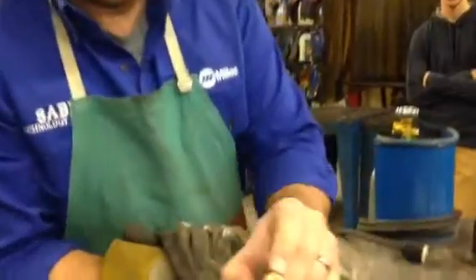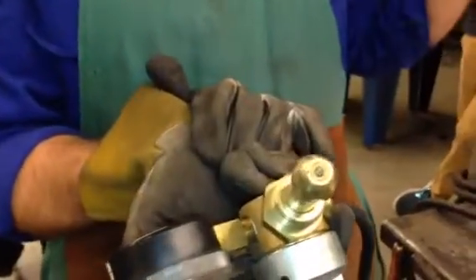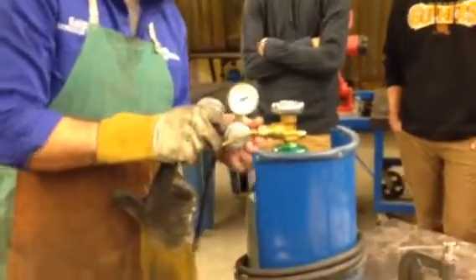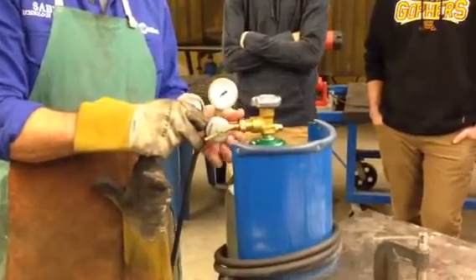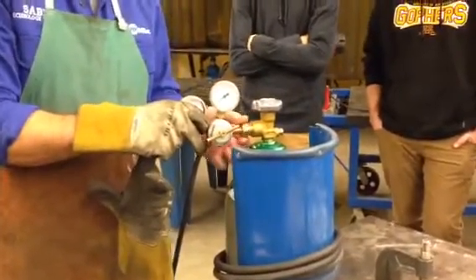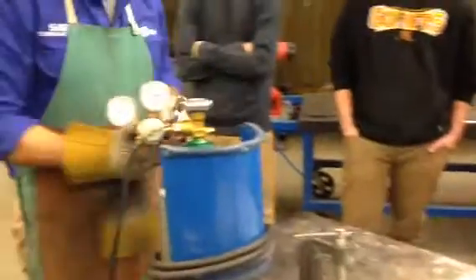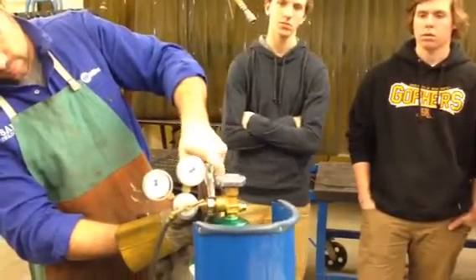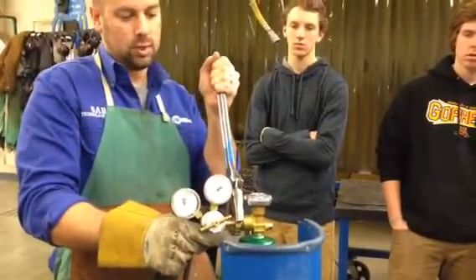This is kind of cool — it's got a sintered brass filter. Essentially, they take a bunch of little brass beads and crush them together. The air can flow through it, but a lot of dirt and impurities can't. Sintered brass filters were really common in old school cars that had carburetors. Now we have fuel injection and paper filters in line. You thread the regulator on — it is a tapered compression fit. Crank it up pretty tight, and tip the gauges back so when we tighten up they come forward.